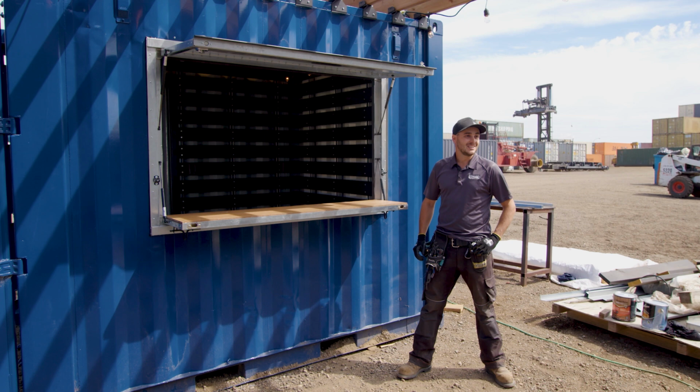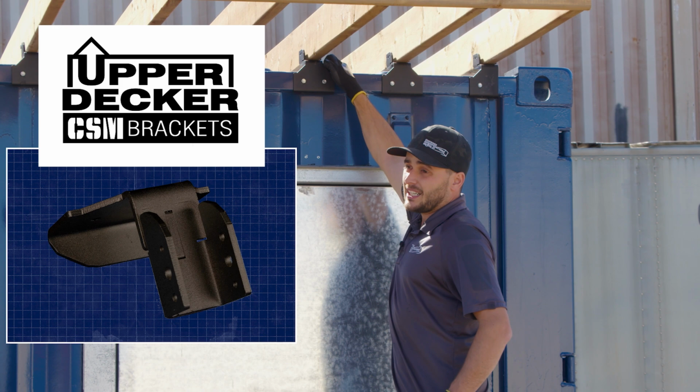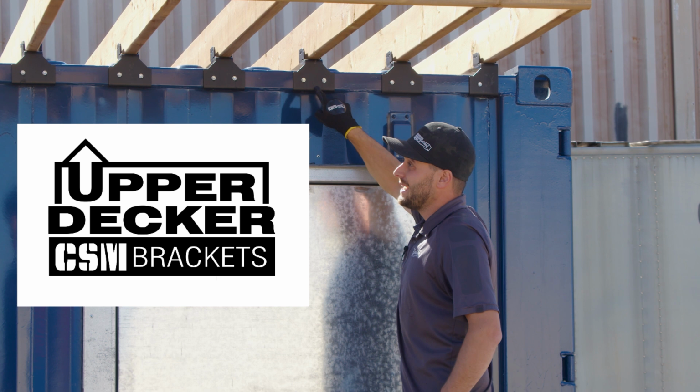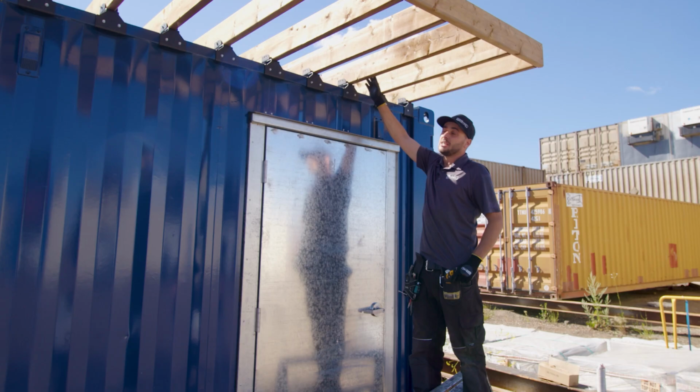So these brackets here are made with 3/16 mild steel. They're white metal sandblasted and powder coated with this nice textured black finish. They have a gusset inside them, and that gusset and this folded profile hug this top 60 millimeter tubing perfectly. And so these screws that go into the top 60 millimeter tubing actually aren't even really required, as long as there are upper decker brackets at the matching corrugation on the other side and a chunk of lumber spanning across.